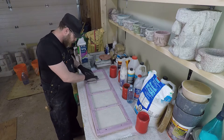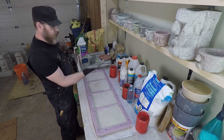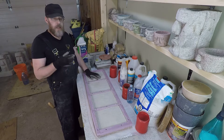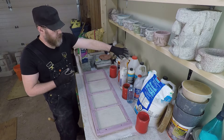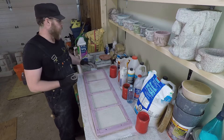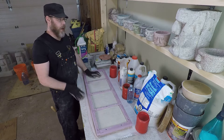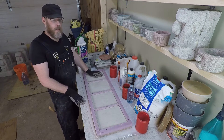When I'm cleaning concrete, there are pores — no matter how much I brush it, there's still dust that comes up and calcium that forms and other impurities that need to come off. That's why I use a mix of approximately seven parts water and one part muriatic acid, put into a plastic sprinkling can like this, and apply it to the area. It'll foam and hiss a little bit, but not overly so because it's diluted.